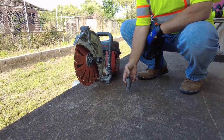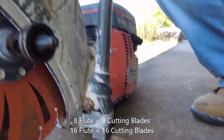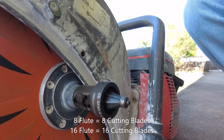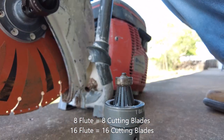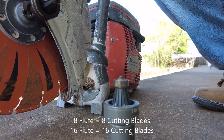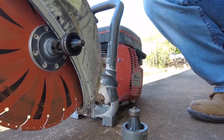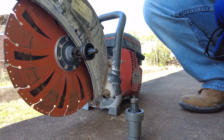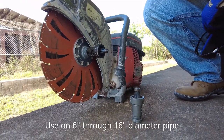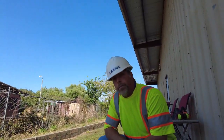When you talk about flute, you mean how many cutters are on there. So the 16-flute takes a little bit more aggressive bite — you can use it on higher horsepower — and the 8-flute is a little less aggressive and slightly slower, but leaves about the same profile on the pipe. These are good for six-inch up to 16-inch diameter pressurized pipe. You need a thick sidewall; gravity-fed sewer pipe is not what these are designed for.